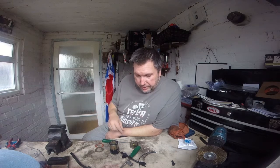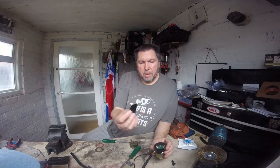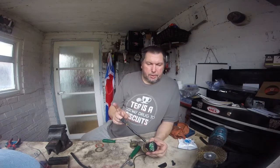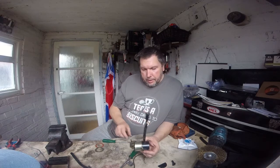Right, I might put the camera down near my chest so you can have a good look at this pump. I was doing power to ground testing. This lid sits on the back here, and you can just pop it off and re-glue it back on. That's the little circuitry, and I tried all the powers and grounds. You can feel the pump working if you put your hand around the shaft and then turn it on. I didn't actually know it was a diaphragm pump.